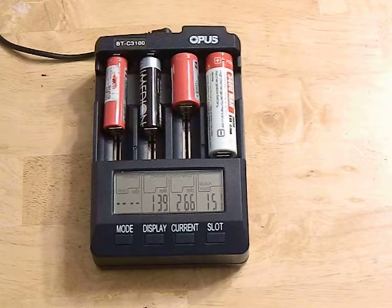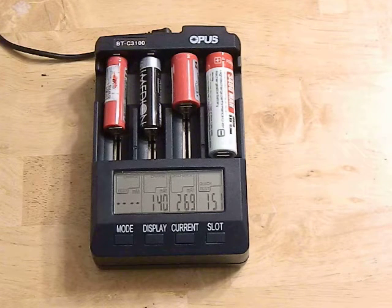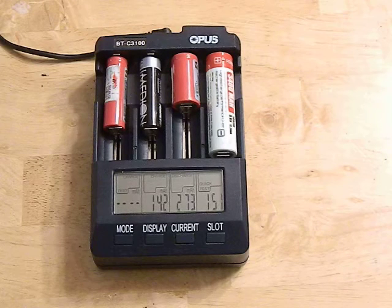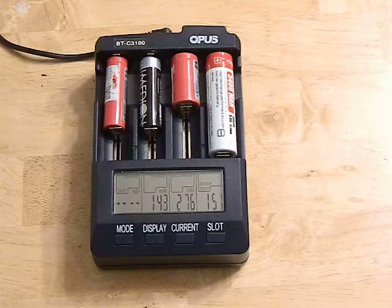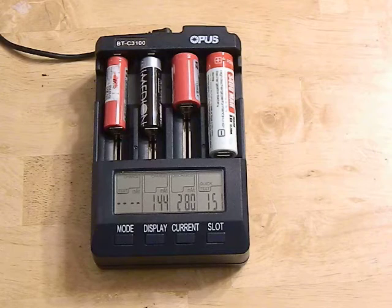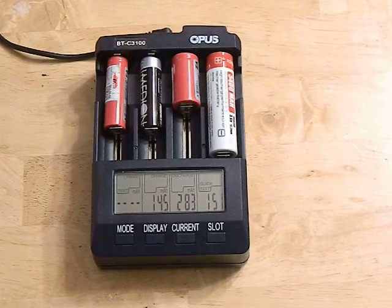Now let's talk about safety, which is one of the most important things to me with chargers. I let this thing run overnight quite a few times and tested the batteries in the morning. I did not have any batteries overcharge — in fact it undercharges slightly, consistently reading around 4.18 to 4.19 volts. When the charger shuts off, lithium ions receive no trickle charge, discharge very slightly from being connected, and then restart charging when they drop below a threshold. Note that nickel metal hydrides will trickle charge when done.